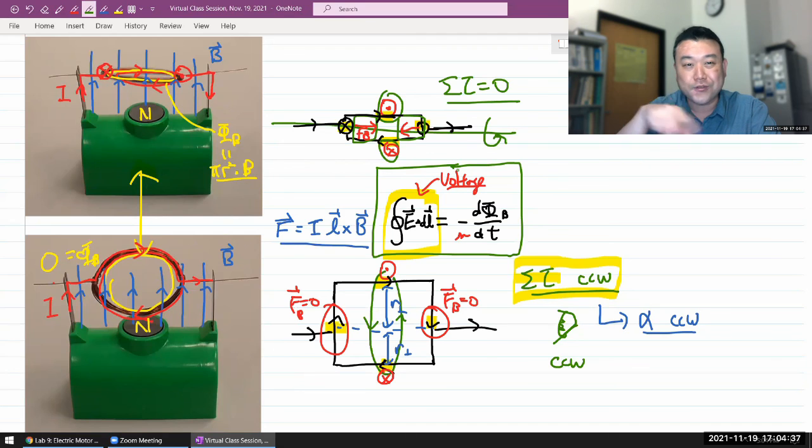It's dangerous to simply stop the motor cold. If you stop the motor, the amount of current that can flow through the coils is no longer limited by the back EMF — it's limited only by the resistance of the wire. A very low resistance wire connected across a battery is essentially a short circuit, which can draw a lot of current and is dangerous. While the motor is running, the induced voltage opposes the applied voltage, limiting how fast it can spin and how much current it draws.